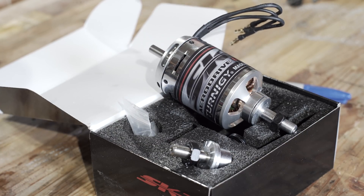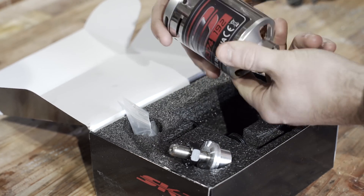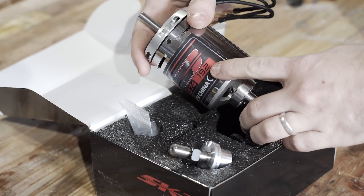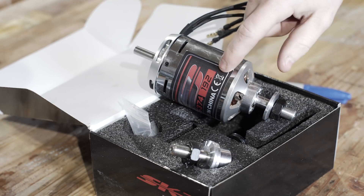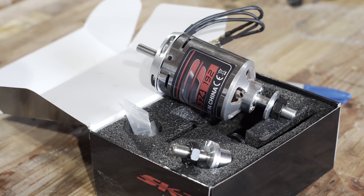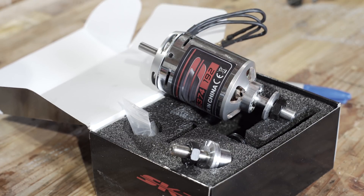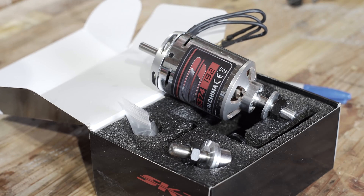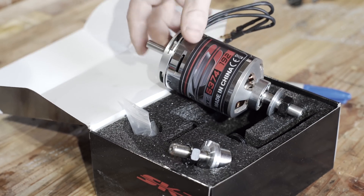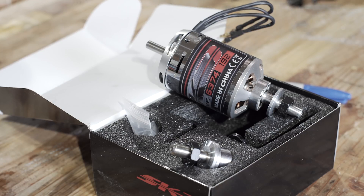Assuming you don't destroy your motor, you just don't get as good performance out of it. This particular motor is 192 kV, which means for every volt you give it, you get another 192 RPM. It's rated up to around 48–56 volts, so the top speed is about 9,000 RPM. I don't intend to run it that fast — it'll be geared down with a pulley mechanism to replicate the range of speeds on the current mill.